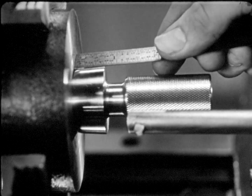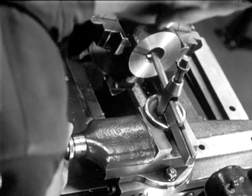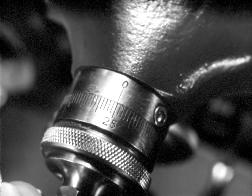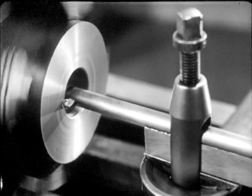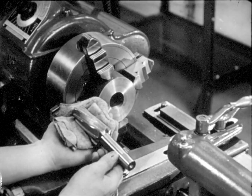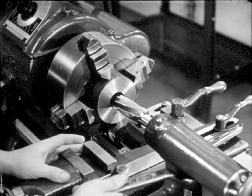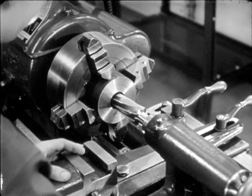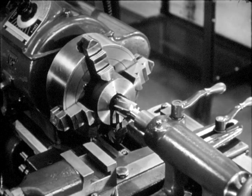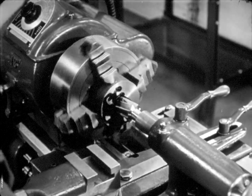To get the total depth of the final cuts, measure from the face of the work to the limit line which is marked on the plug. From this, the amount of metal to be removed can be figured. Five thousandths of an inch should be allowed for reaming. The final cut with a boring tool is now made. A reamer is used for the finishing cut of five thousandths. The machine reamer is placed in the tail spindle. The reamer is then fed into the hole by turning the tail stock spindle wheel clockwise until the reamer bears loosely against the sides of the taper.